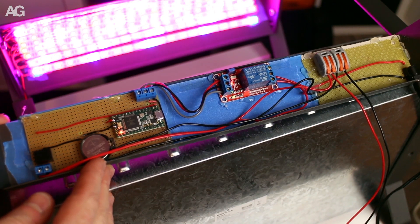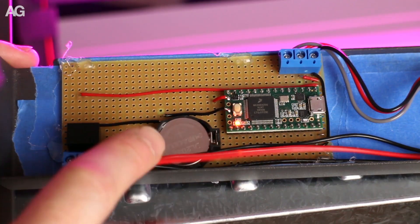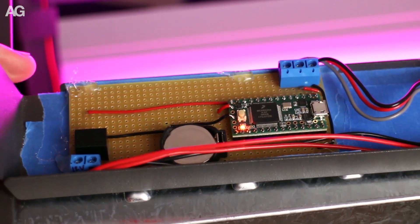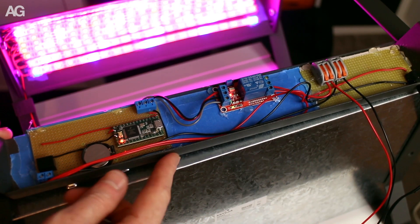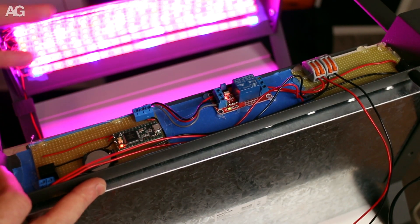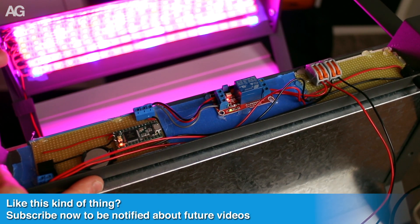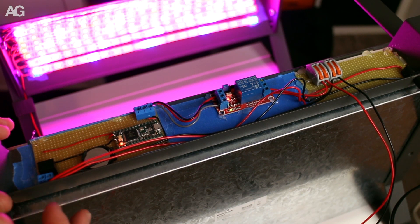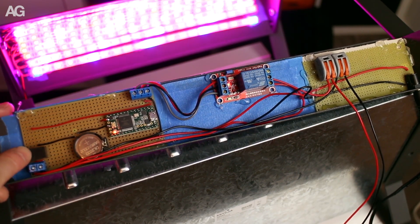In the bottom tray here that sits underneath I've got the same kind of Teensy controller as before, and a backup battery in here. I am now feeding the whole thing with 12 volts rather than 5. The LEDs I've chosen all run on 12 volts so that feeds directly into them, and it's also going to be lower current consumption being a higher voltage, which is good. To get the 5 volts needed for the Teensy I've got an additional regulator over here.